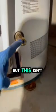The older one was the original it came with. If you have a water heater from around 2007, 2008, 2009, or 2010, they actually used a plastic relief valve. What ends up happening is it expands and contracts because of heat, cracks, and then you have water. So it was replaced with this brass fitting.